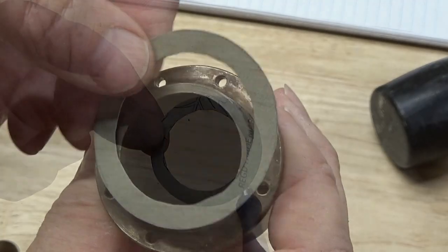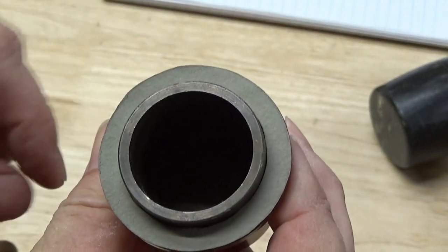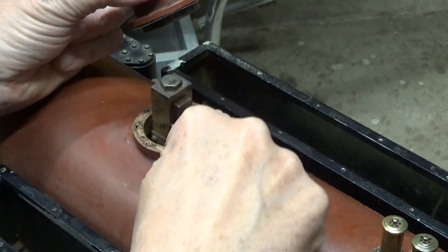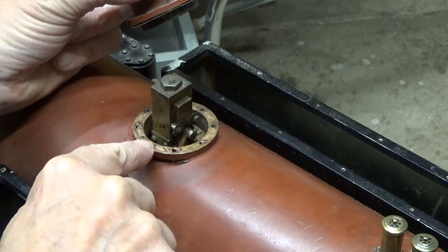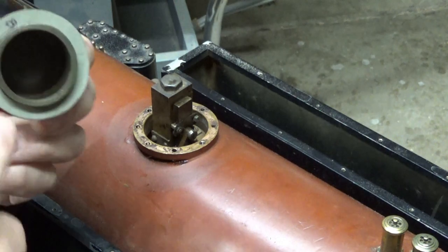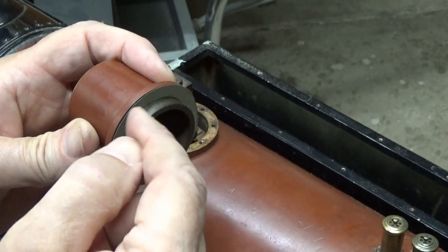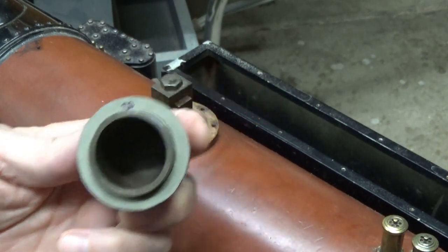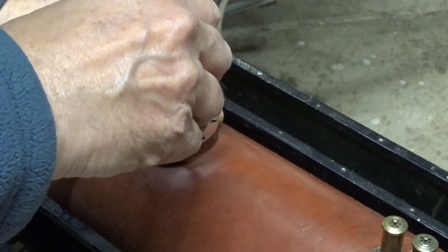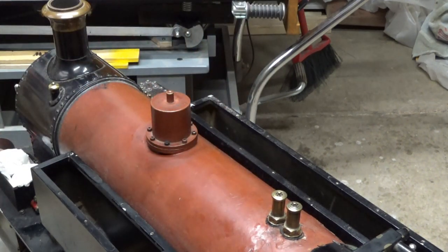Let's see if it fits. Now we have to perforate it for those holes. Since this was machined out by hand, I can't totally rely on the holes being perfectly spaced — geometrically perfect. So I marked the back of the small dome and the back of the gasket so that if the whole pattern is slightly asymmetrical, I can get it oriented just right because of my markings. That's buttoned up nicely.